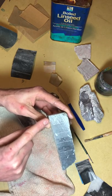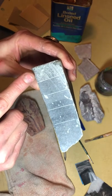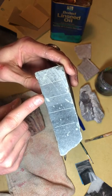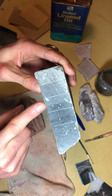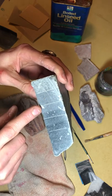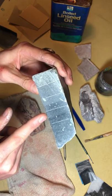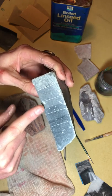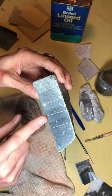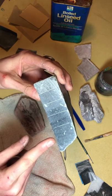Looking at this dry sample board example: at this end I've done maybe 150 to 180 sanding and you can still see scratches, tool marks, and rough cuts — this will not look good once you put oil on it. In the 180 to 220 range it's the bare minimum — you can still see some lines and scratches. But there's a huge jump at 400, where you're getting more clarity and actually a little metallic-type reflection in the stone. At 800 it continues to refine further.